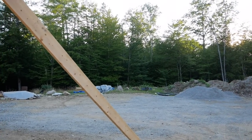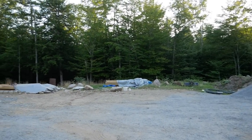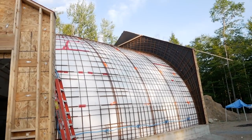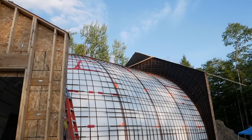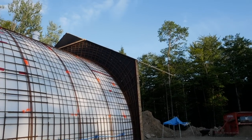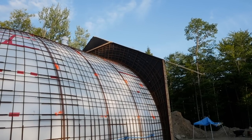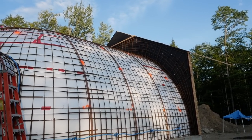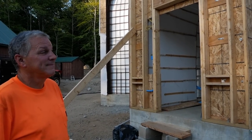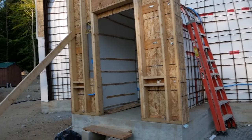And they also climbed up and took off the covering that we had on the chimney, because the chimney is made of cardboard sonotubes. So they took that covering off. They put a couple of wires to hold the 4-inch edges in place because there's a lot of pressure with the ShotCrete. They actually said we did a really, really good job. They said this was great. We did a great job with the forming. It's really sturdy. They did make 2 recommendations.